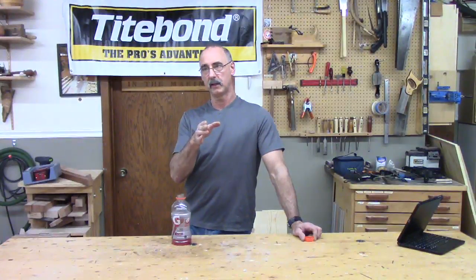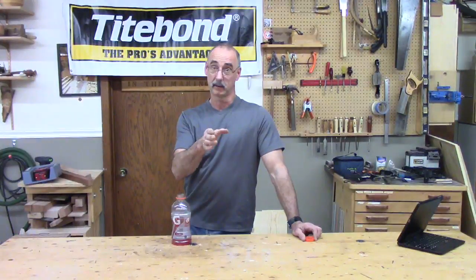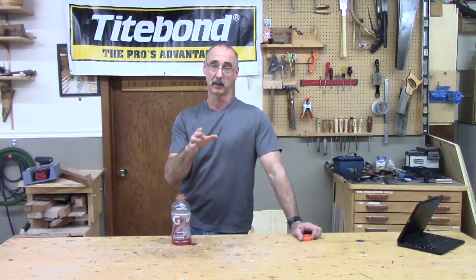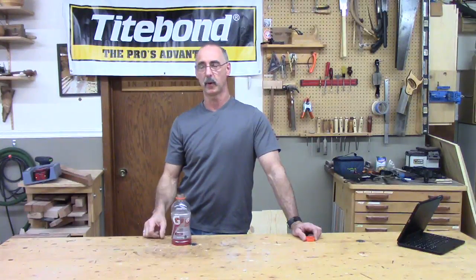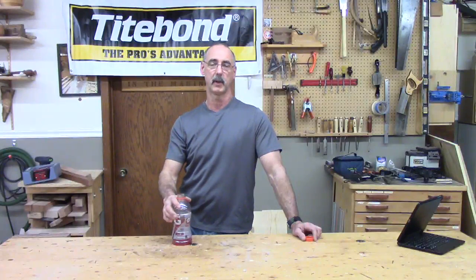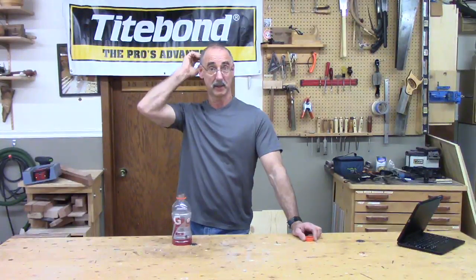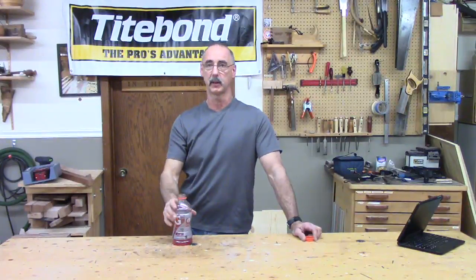So what you can do is if the blade is sharp and you're pushing material and the blade is deflecting, add a little tension. If the teeth are dull, it's going to deflect no matter what, and all bets are off. It's not a tension thing, it's a tooth thing. But I always do a drift check if I'm going to do an important resaw. And like I said, a lot of times I don't have to do any compensation for it, but I would check for it and make sure your blade's properly tensioned and is the right width. You can't resaw 6-inch stock with a 1/4-inch blade. You need a wide enough blade that it's got some spine to it.